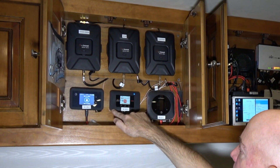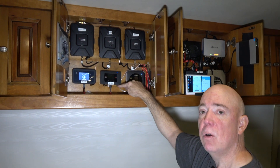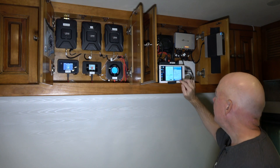Off booster one, one antenna on the driver's side goes into one input and one antenna goes into the other input. On the passenger side, one antenna goes into one side and one goes to the other side — splitting the two antennas between the two different inputs of the jetpack, since it's looking for two antennas for MIMO. I do lose RF gain when you split a signal — the dBs drop — but I'm not too concerned because I'm already amplifying the signal before it goes to the output.